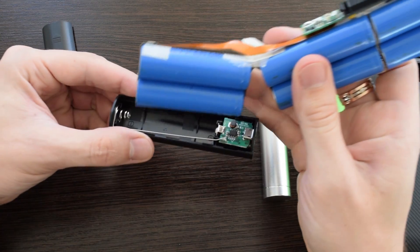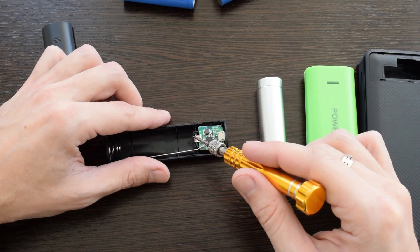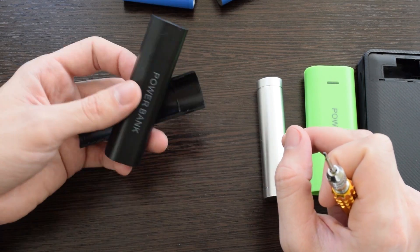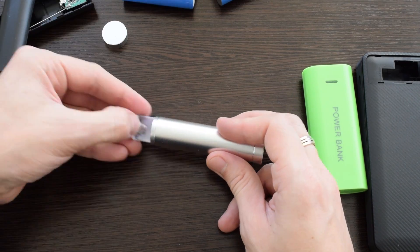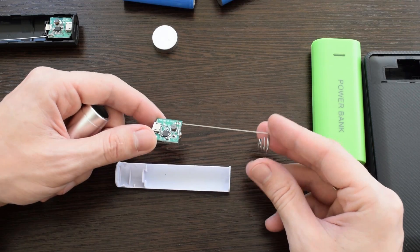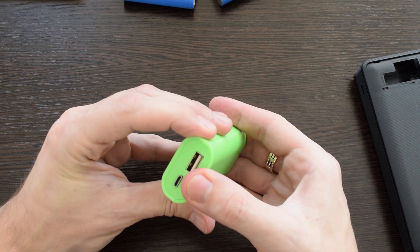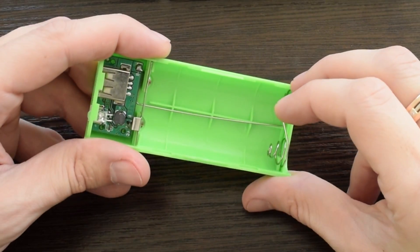All you have to do is just put the battery inside. Pretty simple schematic — a charge controller and DC step-up converter for converting the existing 3.7V to 5V, made of plastic. This other one looks really cool, made of aluminum and costs $1.20. The schematics look very similar and it operates the same way. This case has a button which turns on the power bank or a flashlight. This case fits two batteries, so it doubles the capacity, and the charging port provides up to 1.5A.